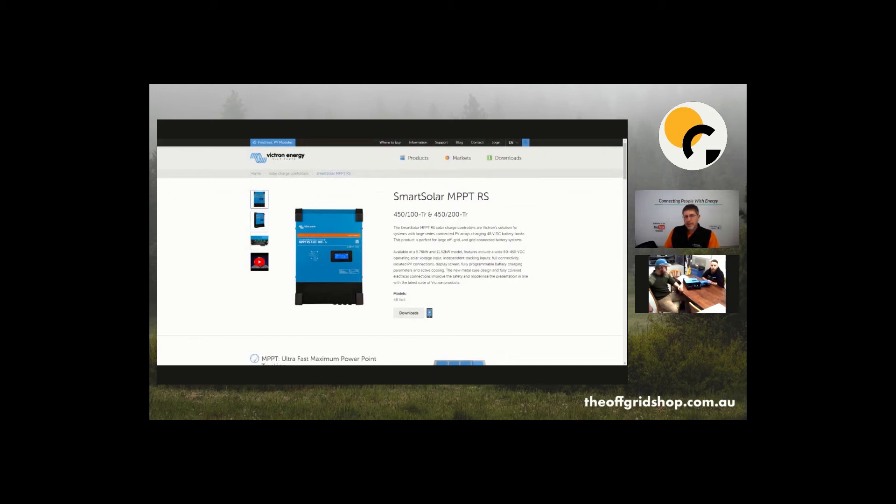These also have an earth fault alarm. For the end user, that means you can see if something is happening with the roof — like a panel has been smashed, soaked up water, and is short-circuiting to its frame. It's mainly for recognizing damage to the array or wiring without getting up on the roof. So if a cable has been damaged, a panel is broken, or something has water in it, the Victron will flag an earth fault and let you know there's damage.